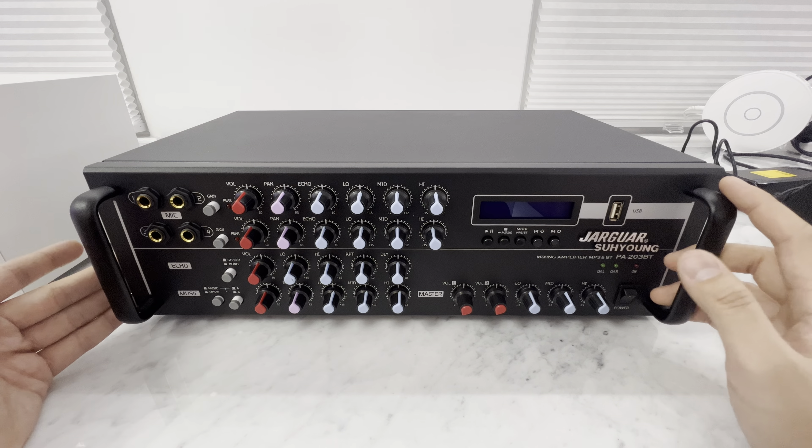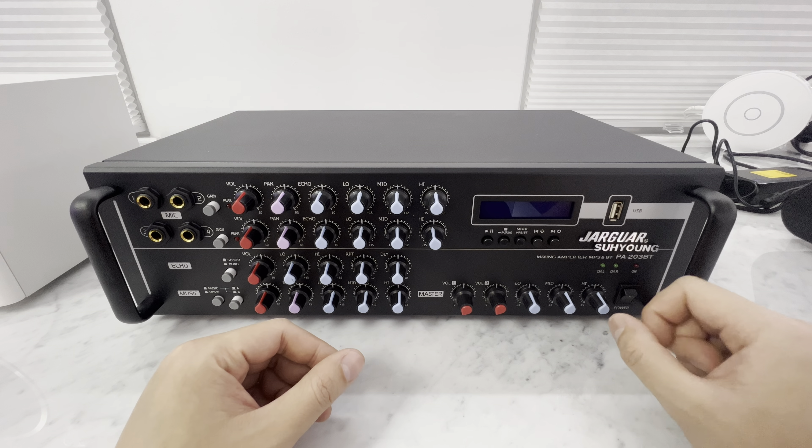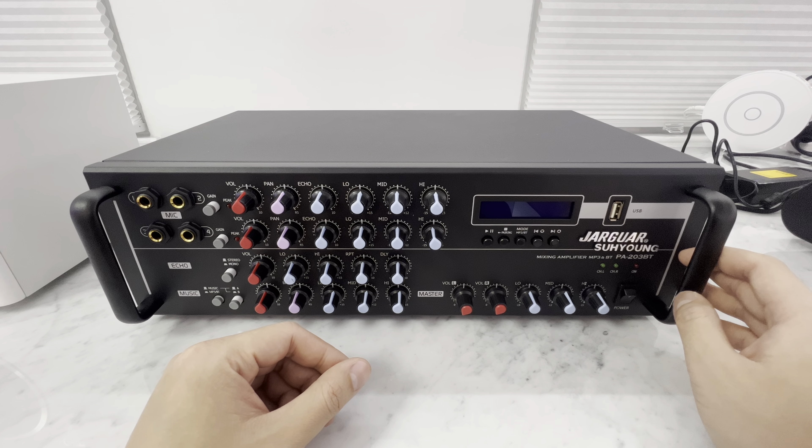This one is 360 watts RMS, which is the real power it's going to put out. A lot of manufacturers like to spice up their numbers by saying it's a 500 watt amplifier, but that's the max power — that's not RMS. So their real power is 250 divided by how many channels it has. If you're at 360 RMS, the max is 720, divided by four channels. So each channel is going to have about 180 watts of power, which is more than enough for most usages. But don't think you're going to open a bar or club with 10 booming speakers powered by one of these — they need much bigger, much more expensive amplifiers.